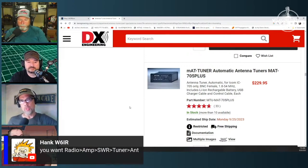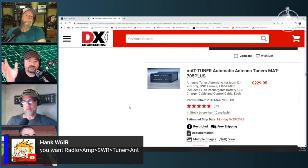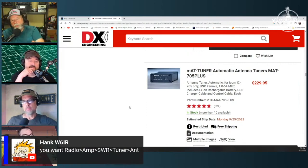Do you want to know that your tuner did a good job and found you a match, or do you want to know that your SWR is good before your tuner and not know what it is after your tuner? So, like Ape said, some people put two SWR meters on. Yeah, and so I can see what Hank's saying if you wanted to monitor the SWR coming into your amp, right? Because the challenge you have there is that if you have too high of an SWR coming into the amp, it can be problematic.